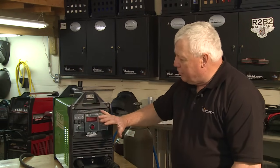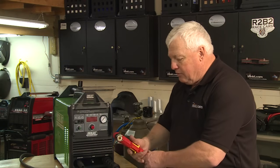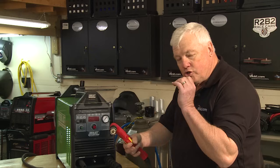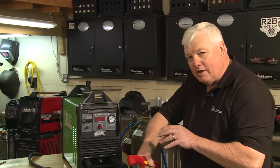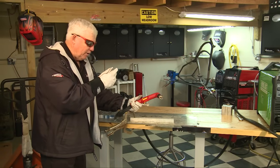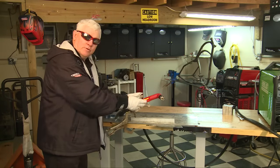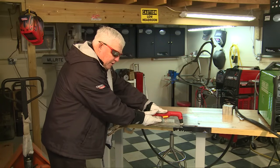Once we have everything in place — amperage set, air flowing — all you have to do is pull this little safety device down and pull the trigger. Very shortly it's going to shoot an arc, and I'm going to start cutting at about a 15 degree angle. Once I get penetration, it's going to be a square cut all the way through. I've got my guide in place, I've got my steel — it's about 16 gauge, which I do an awful lot of. The machine is set at 25 amps, which should be adequate to get through this material. I'll go ahead and hit my pre-purge at a 15 degree angle.